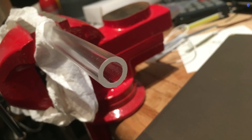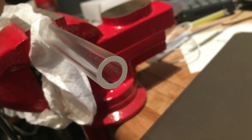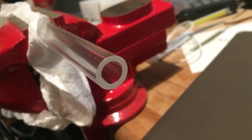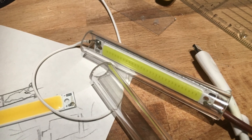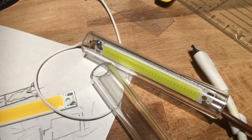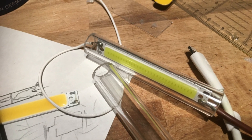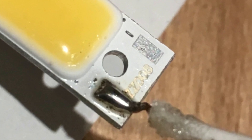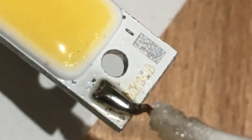Let's go into more detail from the construction phase. These are just 12 millimeter acrylic glass tubes, which you can get pretty much anywhere, and they are 2 millimeters thick, giving you an inner diameter of 8 millimeters. That's a perfect snug fit for these COB LED strains, and also enables you to use the openings on each side to get the wire in and solder them together. You don't have to crisscross any wires — you just enter on one side and exit on the other.